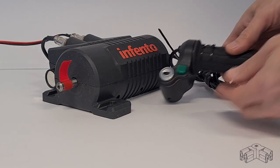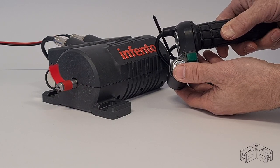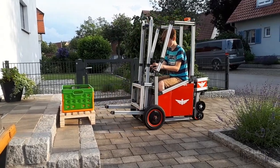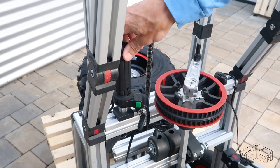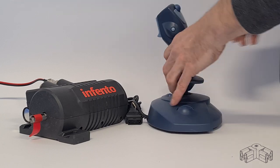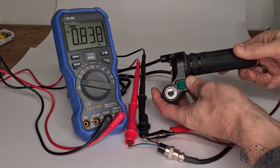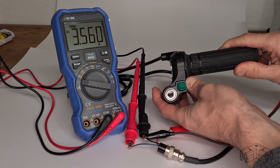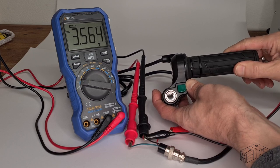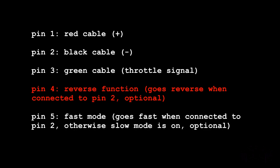Normally you can control the e-pulse motor with the Infento Motor Bike Style throttle grip, and that's quite okay. For going into reverse direction, you have to push a separate button first. But since I built the forklift, I was dreaming about an intuitive joystick control for the e-pulse motor, where some mechanic or electronic gadget would automatically operate the reverse contact when the joystick is pulled backwards. The e-pulse motor is controlled by an analog voltage that comes from a Hall sensor inside the e-pulse throttle grip. I determined the limits of this voltage with a voltmeter — between 0.8 and 3.5 volts. I also figured out which connection had to be shortened to switch the e-pulse into reverse.